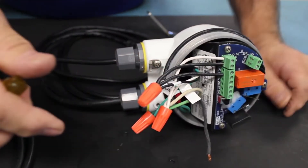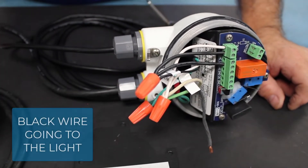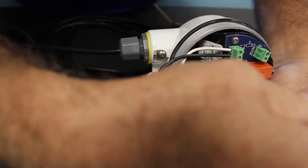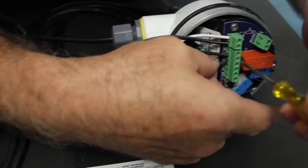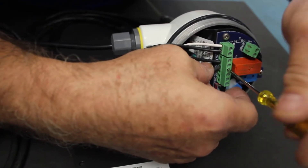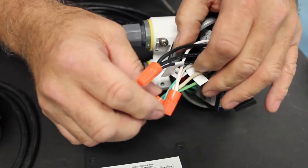Check to make sure each wire is secure in the wire nut. That leaves one wire left to connect — the black wire in the cable going to the light. We will connect that to the 1NO terminal, which will give us 115 volts on it when the paddle is covered. Make sure those are all secured in there.